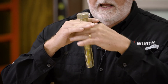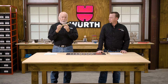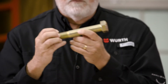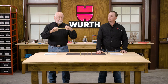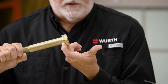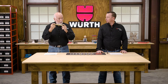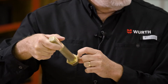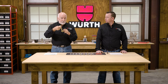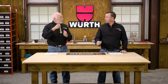You put a nut on the back side. Now the important thing is the proper way to assemble is to rotate the nut. When you think about that, the bolt head is just being held steady, so there's no bearing surface or frictional forces to be concerned about there — it's the nut that's rotating. Therefore, for a bolt, the underhead bearing surface is not critical, and bolt specifications are written loosely as to what the surface condition has to be.